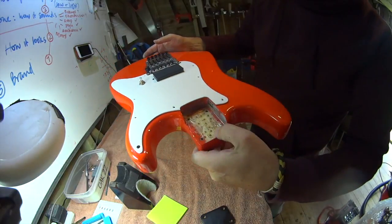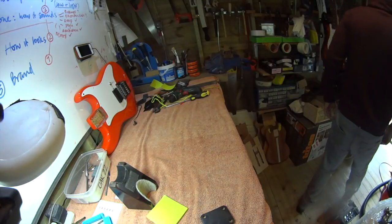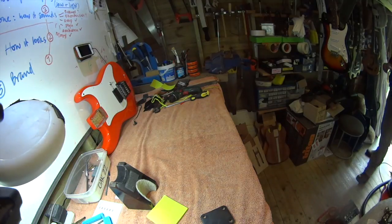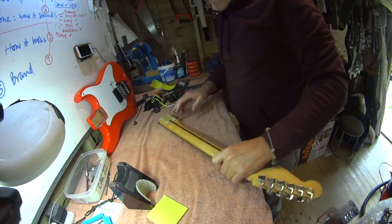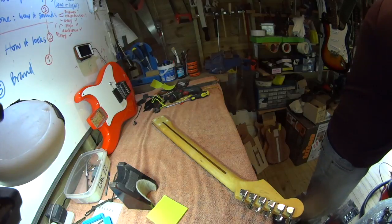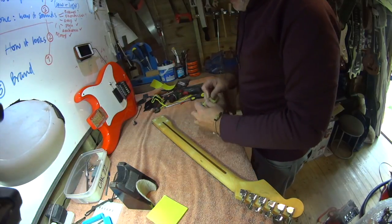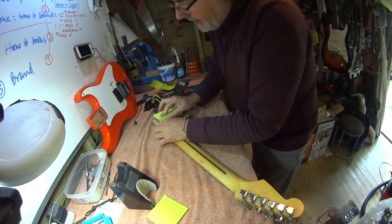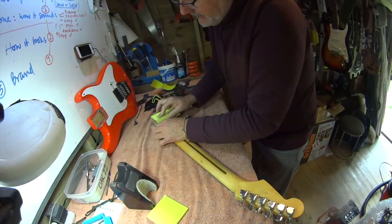We've got our new permanent resin wedge, which is cool, but we need to just sand flatten our new heel arrangement with its plugs. But we also have to drill some pilot holes once we're flat. We're pretty flat actually, so I could get me a bit of 180 would do, just to make sure that we are nice and flat. We don't want anything interfering with the nice level we've got. We're just working inside the visible area, stuff that's under the heel, to make sure it's nice and level.